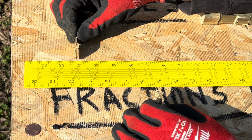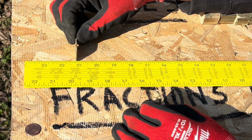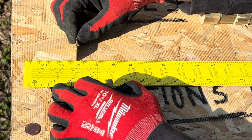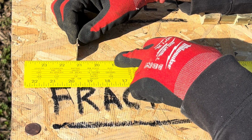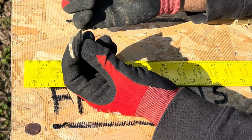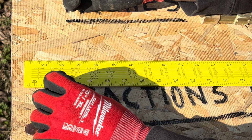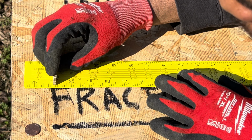You can look at my framing square and look, it's in between the 2 hash marks or increments or graduations. Now, this scale over here is 1/8 of an inch scale. You see how wider the spacing is than the top? This is a 1/16 of an inch scale. This is an 1/8 of an inch scale. Look how wide my piece of scrap is right here. It's 2 times wider than my 1/16 of an inch. Take a look. I don't know if you can see it, but you can. Let me put it right here. Okay, that's an 1/8 of an inch.